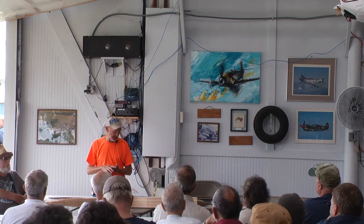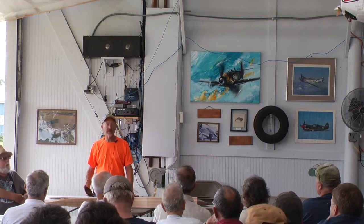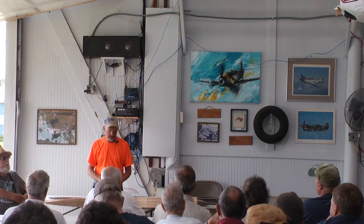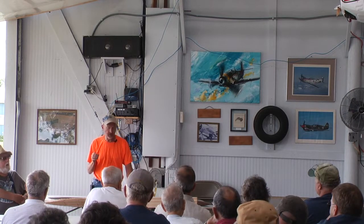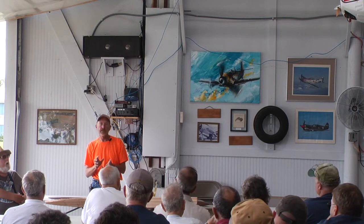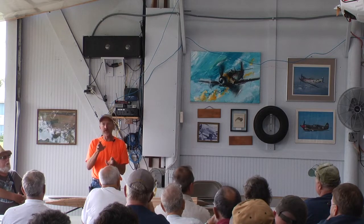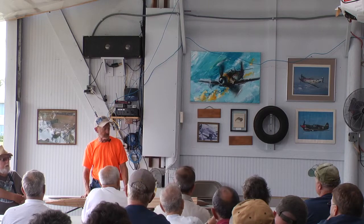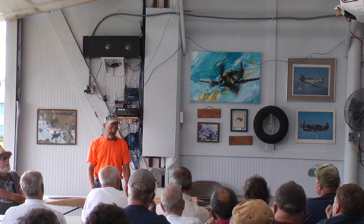I actually did that on the first propeller, and the second one I didn't. I was just trying different things. It ended up that I was maybe off. I had minute discrepancies when I tried to ultimately bolt it on the propeller hub. It wasn't off by very much. I just kind of fudged the hole a little bit to get the bolts to line up. It never really created too much of a problem. But the second time I did it, I just drilled all the way through.